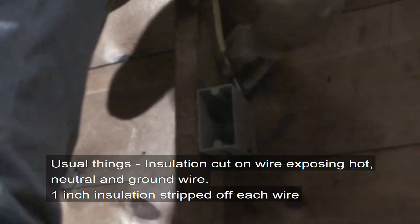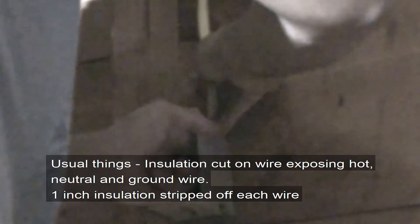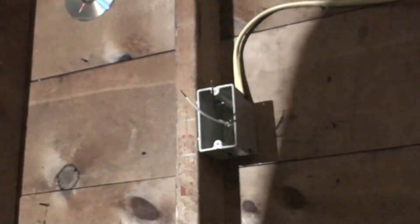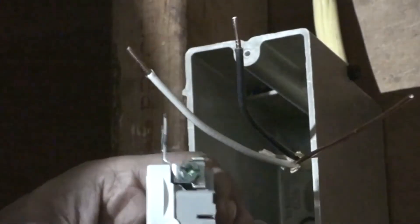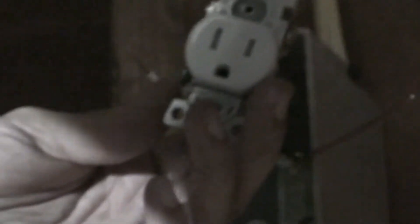I'm going to push this through the little opening here. We have the three wires — it's always good to have a medium nose plier for this. I usually connect the ground wire first. For the ground wire you need to connect it to this green screw here. I'm going to twist this upward — see that loop I created right there — put this right on there. Even nicer would be to twist it a little more than needed and then loop it right around there. Now I'm going to tighten this.